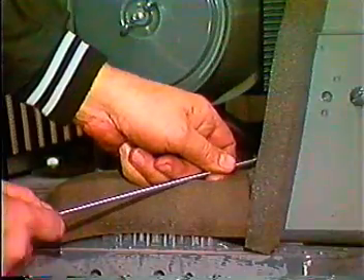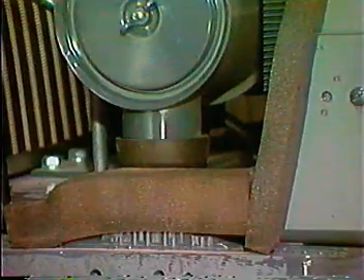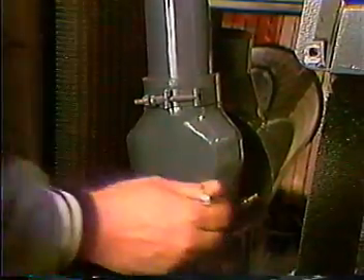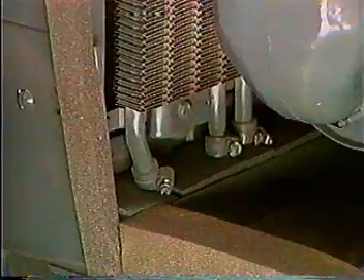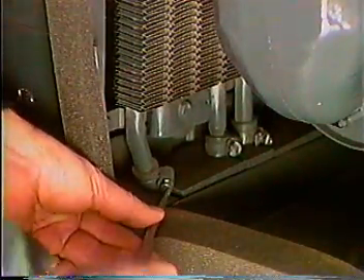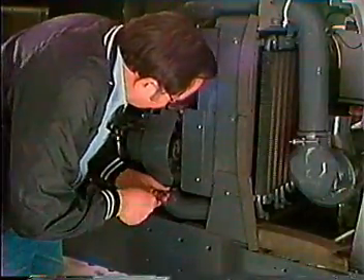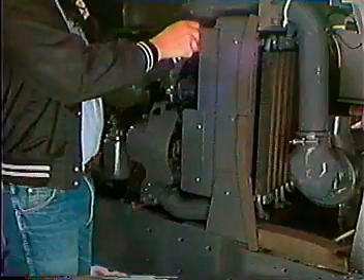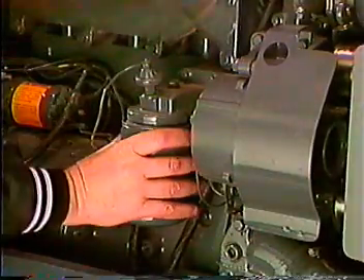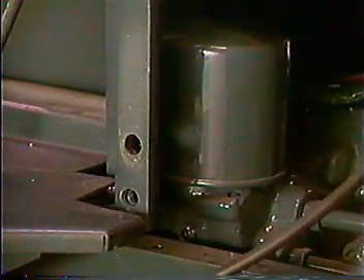While the screened air inlet is open, check the clamps on the hydraulic system cooler lines. Do not reinstall the screen at this time. At the right-hand side, check the clamps on all hoses connecting the air cleaner to the engine. If your White American 60 or 80 has a three-speed power shift, be sure to check the cooler hose clamps. Check the clamps on the coolant hose from the lower radiator fitting to the inlet fitting on the engine, and also check the upper radiator hose clamps. Check the engine oil filter and make sure it is hand tight. Then check the auxiliary power shift filter to be certain it is tight — it only needs to be hand tight.